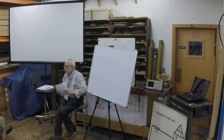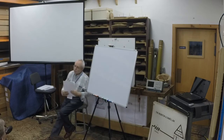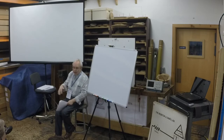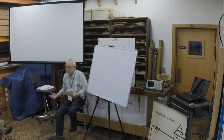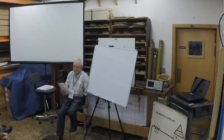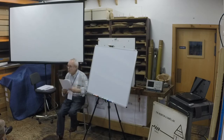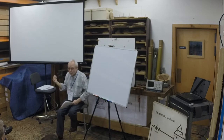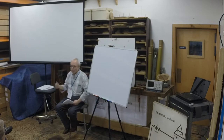And that's done intentionally so that if you're going through the organ and doing show and tell by saying, and this is the slider and this is what it does, if you leave any on, when you come back to the console and switch the organ on, which of course has all the stops retired because everyone does nice, tidy housekeeping, you switch it on, you want those solenoids to immediately reflect the state of the draw knobs at the console. But it does mean it's absolutely the worst case when you first switch on.